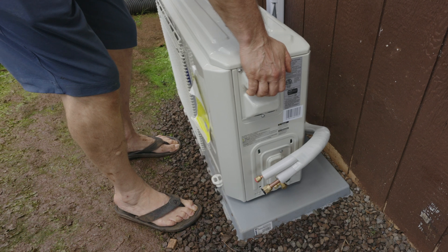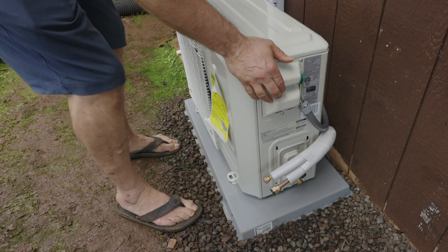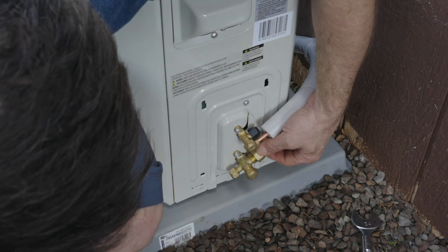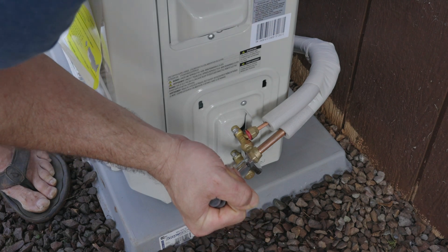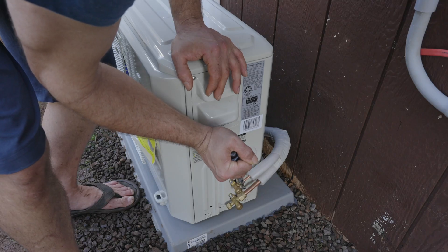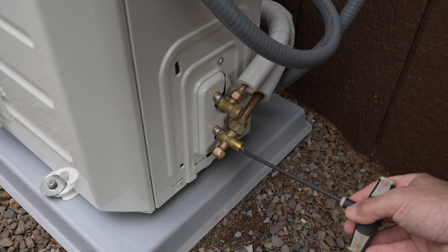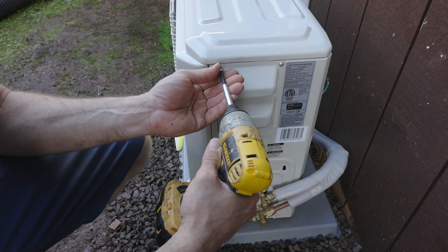After the drain line went through the wall, I ran it down the wall with PVC, took a 90-degree bend, and ran it off the side of the cement slab into an area where water can drain. The line hide came in white — I painted it brown to match. I have an irregular configuration around one corner but I didn't want to over-bend the pipes. We'll place the outdoor unit onto the mounting pad for a dry fit to make sure the control wire lines up and the piping is bent reasonably. Using Nylog, make sure it goes on nice and easy hand-tight — then use a torque wrench to achieve the specified torque value. We don't want to over-tighten and ruin the flare fitting, and we don't want to under-tighten and have refrigerant leak. On a Mr. Cool unit this is where you'd be finished with the plumbing; on a non-Mr. Cool unit, this is where you'd begin your vacuum evacuation. Once the plumbing is complete, use a hex key to open both valves and allow the refrigerant to slowly enter the system.